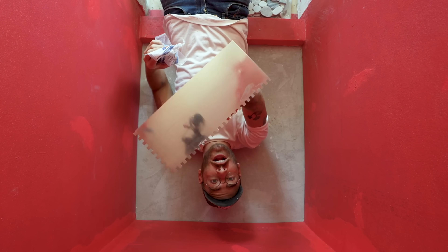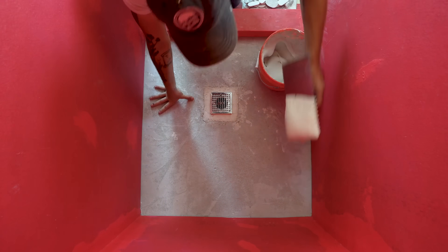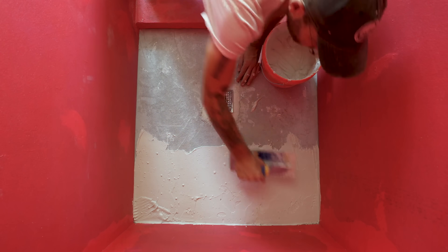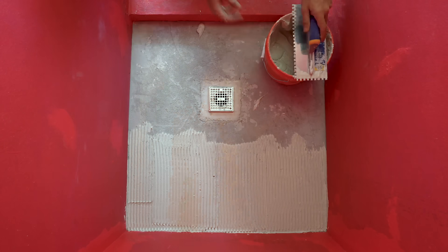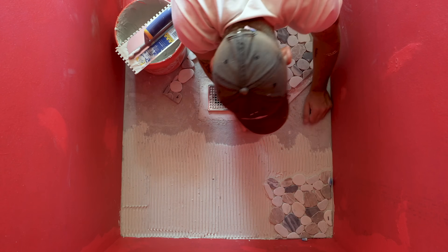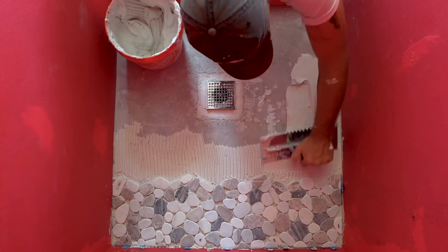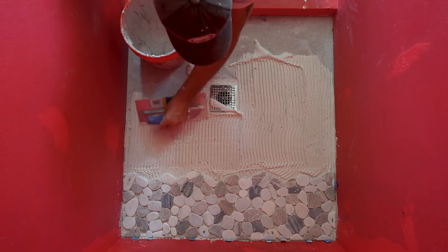It's game time. I'll be using a quarter-inch square-notch trowel and these wedge spacers around the perimeter. The first thing I did is use the flat side of my trowel to spread thin-set over where my first row of tile is going to be, and once it's spread I'll use the square notches to create grooves in the mortar — this gives the thin-set room to squeeze and level as the tile gets placed. You don't want to just butt the first piece up to the corner; use spacers to make sure there's a little gap for wiggle room. I'm not using spacers between my tile sheets, but make sure to use eighth-inch or sixteenth-inch spacers if your tile requires it.